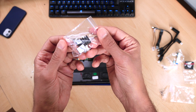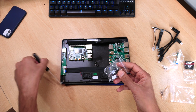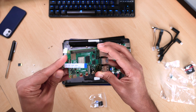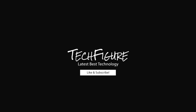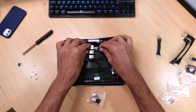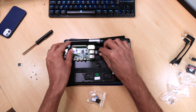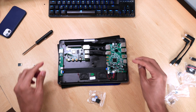Next I'm going to apply the heatsinks supplied to the Raspberry Pi 4 in the three locations, and I'll also insert the SD card ribbon into the Raspberry Pi 4 to connect the other end to the Raspad board later. The first connection I'm making is the Ethernet connection — connecting it to the Raspberry Pi 4 and then to the main board of the Raspad. In the same manner I'm connecting the USB 3 cable to the Raspberry Pi 4 and the main board on the Raspad, giving us USB 3 access.